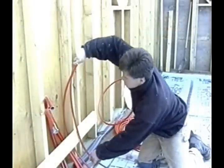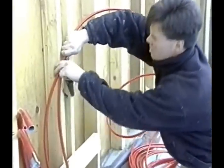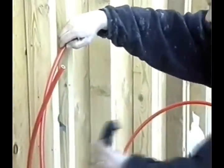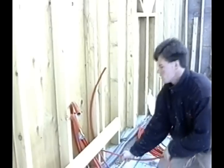Once it's been decided which pattern type to use, find the area best suited for your remote manifold. It should be as centrally located as possible and easily accessible. Cut the end of the tube clean. Fasten it down at the base of the manifold location, leaving 3 to 5 feet of excess tubing.